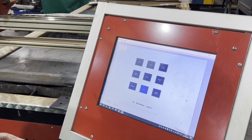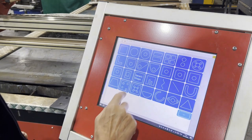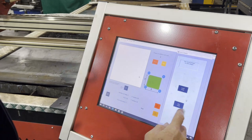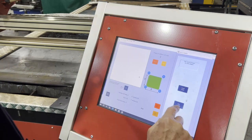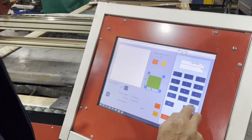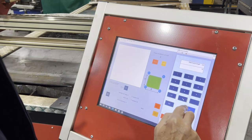To use the common line cut facility, first we need to make a shape. So we'll go into our flexi shapes, choose our favourite generic shape, and we'll make ourselves a rectangle. It needs to be a rectangle or a square — we can't have any radius on the corners for obvious reasons. So we'll do a new shape: 100 wide, 180 long, with a 10mm lead-in.